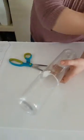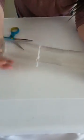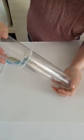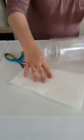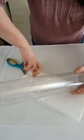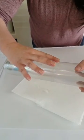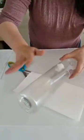all the way around. Now the reason we had you pull it out an inch from where you want it is because now we're going to push it back together. And that's what's going to get the silicone inside the seam to really seal it up. Now this part gets a little bit messy. I'm going to grab a couple towels because I use my fingers to do this. And we're just going to work our way around and just wipe off that silicone. And it gives you a nice clean edge. It dries clear as well, so it doesn't stand out, and it just gives it a nice clean finish.